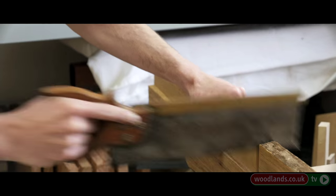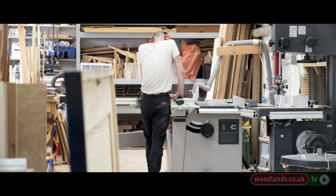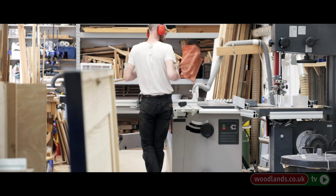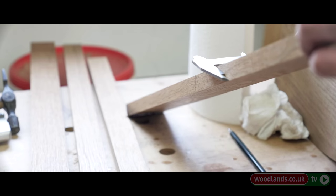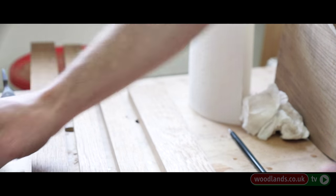The timber expands perpendicular to the grain, as opposed to along the grain's length. With veneer, you can lay pieces onto a groundwork in any direction you like, and the groundwork will hold them where they are. Whereas with solid wood, the timber's going to be moving — you can't just glue bits together. You have to make sure the grain is in the right direction.